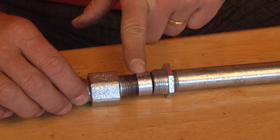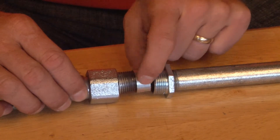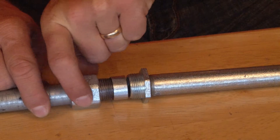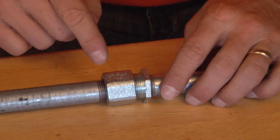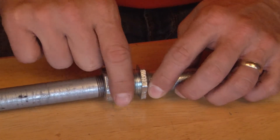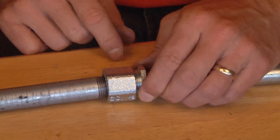You can use this as an adjustment mechanism — the deeper you need to screw it on or the looser, either way. You can now bring the gland ring up, which will allow the fitting to connect to the other chase nipple and join both ends of the conduit.